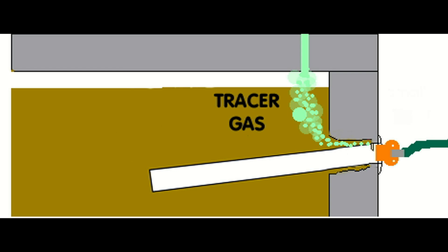It's perfect because the ideal place to add the tracer gas is the port closest to the area that has a suspected leak. This makes gas detection much quicker than waiting for the gas to flow all the way down the pipe to reach the leak.